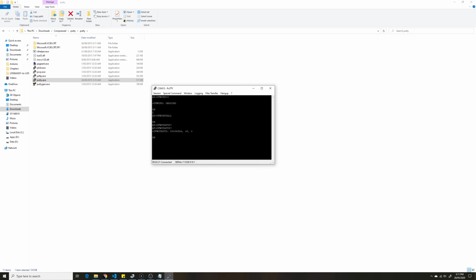Once you're done with this step, the next step is to upload the bigger file. The process is again the same. You'll send AT+UFWUPD=3, just checking my commands, yep, and you will repeat. This will echo back the same command. Just don't press anything. Stay there for a minute, a couple of minutes, and you should receive an ongoing message from the device.